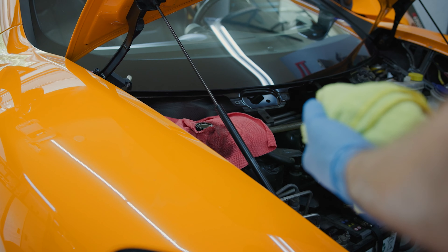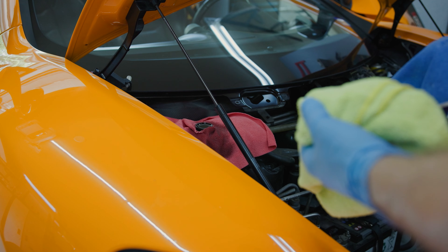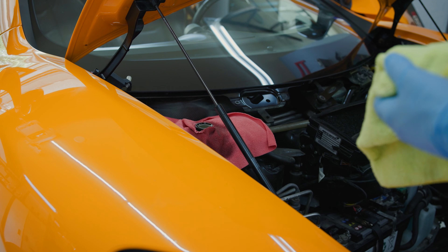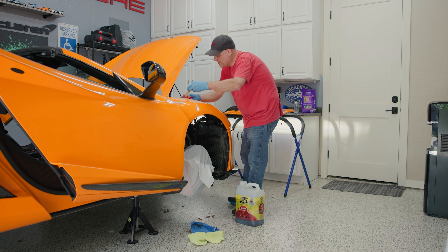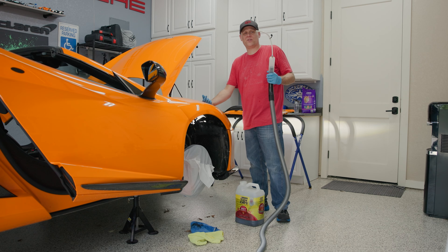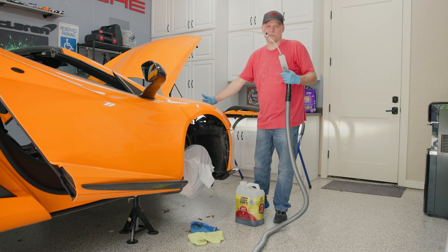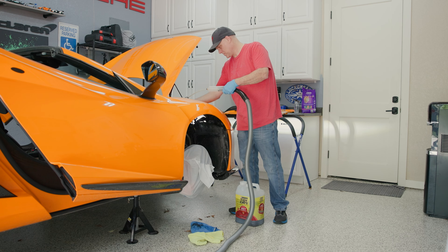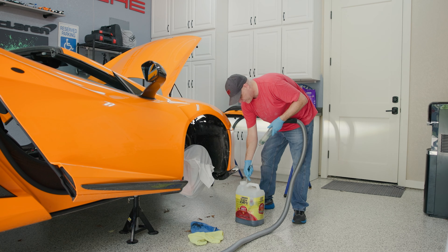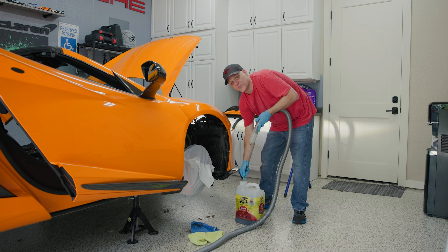Let's go in there and start replacing the accumulators. It was pretty anticlimactic at the computer, but we're basically at the top now so we're going to drain a little bit. We're going to use this suction tool for getting out this excess power steering fluid before we start the accumulator replacement. Power steering fluid and transmission fluid mixed together will not be going back in the car.